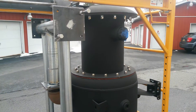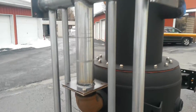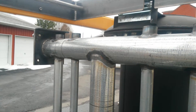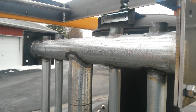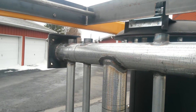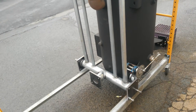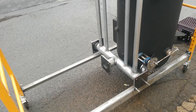I've got to make some gaskets for in between all these flanges. I did tack-weld all of these, so I had to sand all of the galvanized off before I could tack-weld — otherwise it would have been a mess. You can see I have these couplers cut in half and welded to the top so I can put plugs in those; they're going to be access areas to clean out the tubes right down to the bottom. I can take the side plates off and clean out across the bottom, and of course this is the output of the radiator right down here.